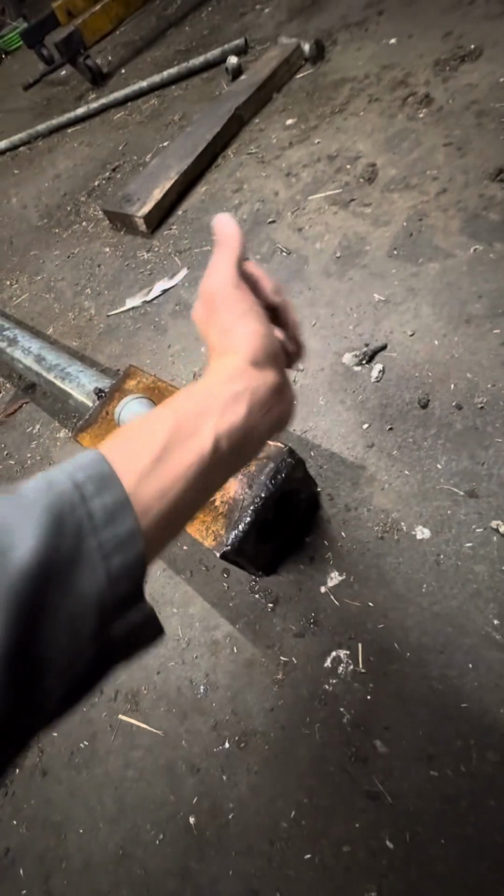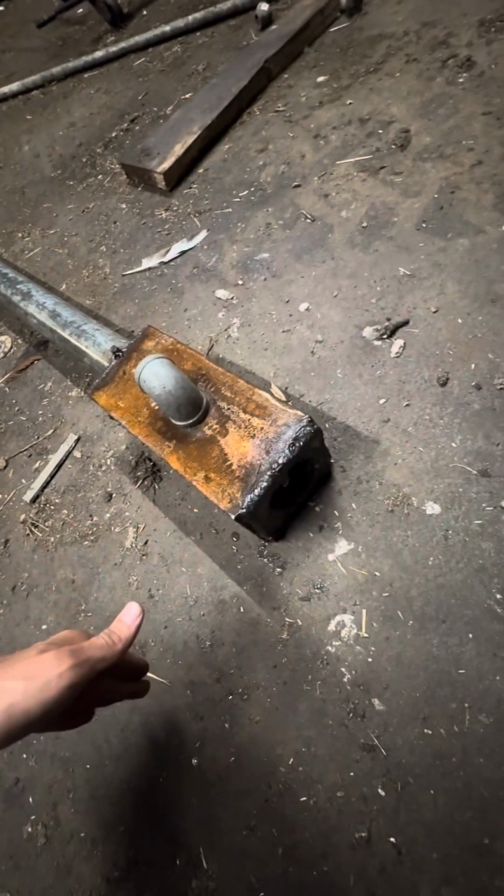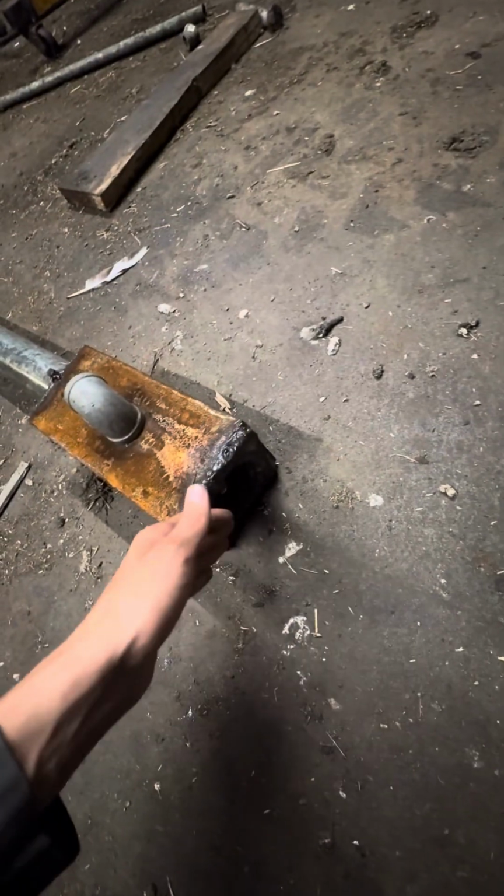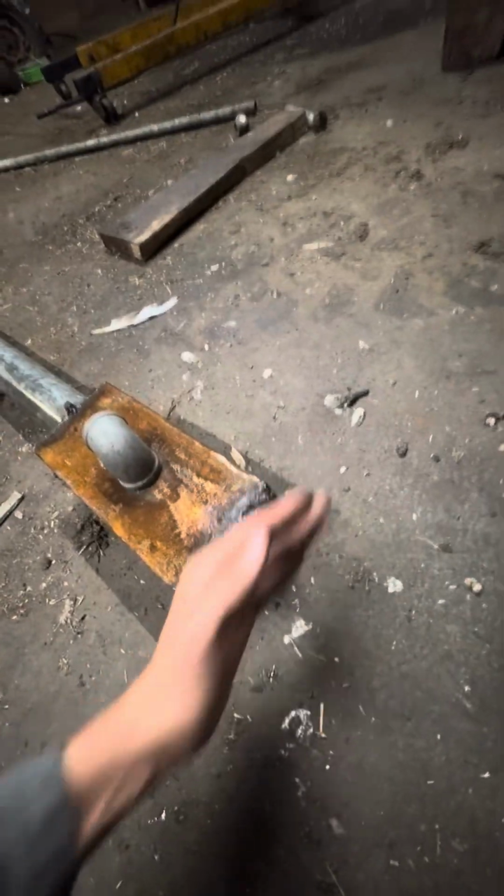And on the back, I'm going to weld a lever where, if I pull it out this way, it swings the gate back and will allow you to either put a shell in or eject the last one. You just simply swing it back and it shuts the gate, which is also going to have to be very, very precise, because if it's not, it's going to leak air and that's going to make me lose PSI.